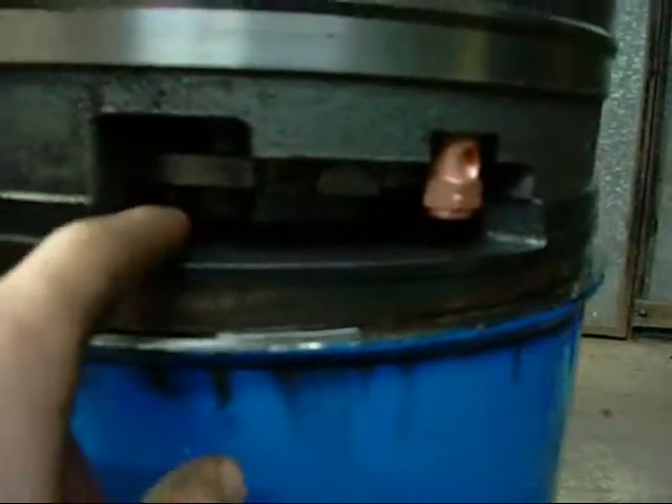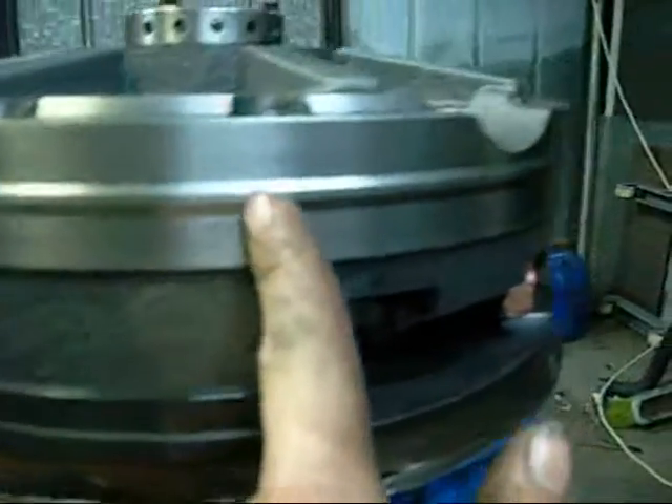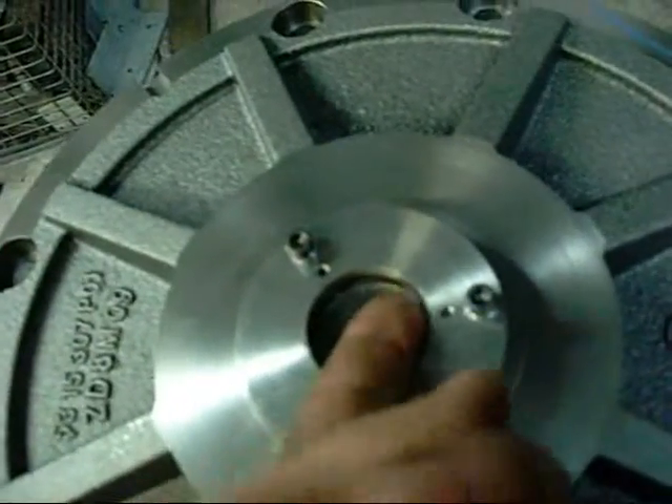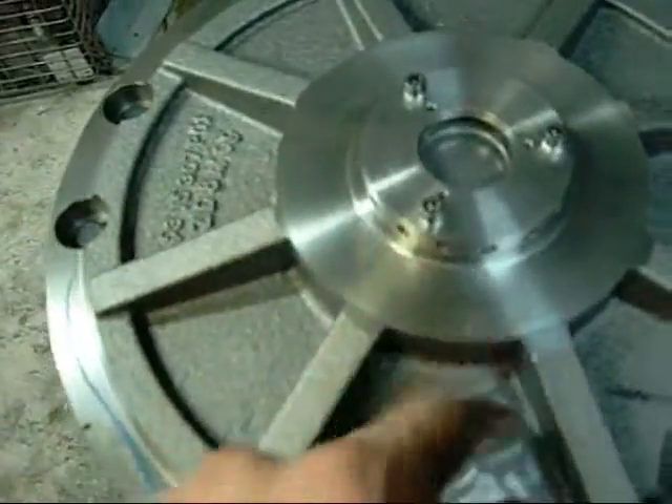This is your low pressure side in here. There are gaps down here that go down into the crankcase, which is your suction side. And up here where the head is actually pressed into the outer housing, this area here is your high pressure. And this is your discharge valve — a little floating ring in here. Under that are your passageways straight out of the centre of the scroll.